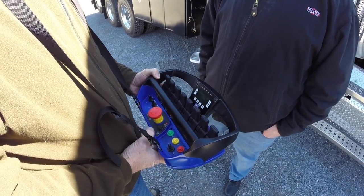Our display is going to show any error codes we have or any function we are in. Your load on the crane will start showing at 80%; as the load increases it will hit 100% and will stop the crane. When everything is good, you'll have a green solid light and a running dot-dash on the bottom of the display.